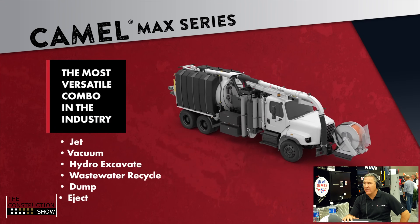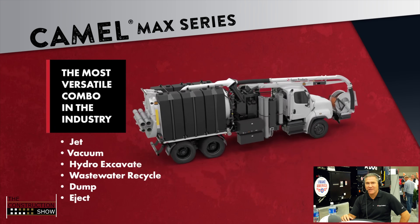Most people have seen them without realizing it - that's the snout you always see over in the sewer. They're actually putting pressure water in there: they run a nozzle all the way down, shoot it, and then bring the nozzle back, which pushes that material back out. The material - dirt, mud, whatever - comes back and gets vacuumed out. Then they'll run a camera down there to make sure everything's clean and there's no damage.